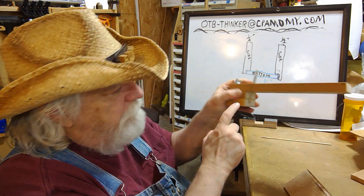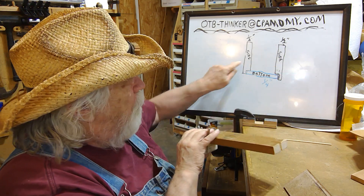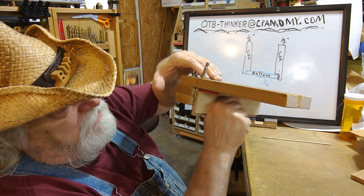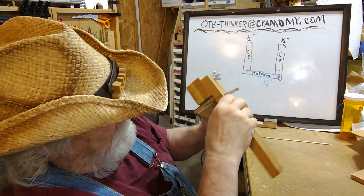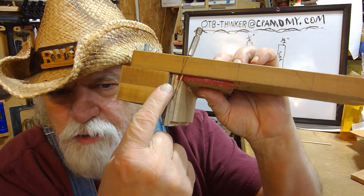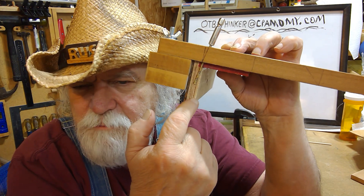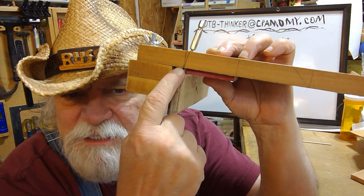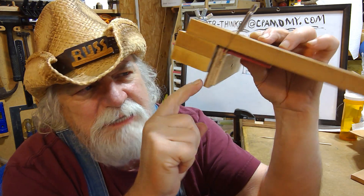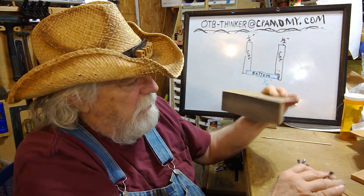Here's an example — half inch and quarter inch. I take my fence on my jig, this is the bit, and I have it set to a half-inch thick board. If I put this up to my joint, you can see the bamboo skewer is going into this side piece. This would be called the top piece and this the side piece, even though it's really the bottom. You can see it's going directly into the side grain of this plywood — it's not going into the joint, yet it still goes deep enough and isn't coming out the side.